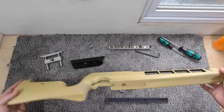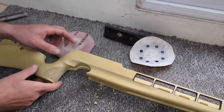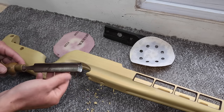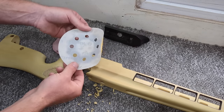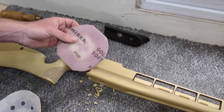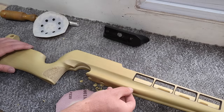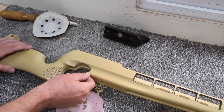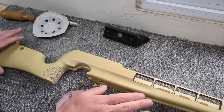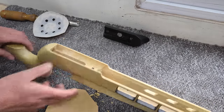Right, let's get the chisels out. We're going to knock off a little bit off the edge here and then start keying it up for some paint. I've just put a little bit of a relief in here that straightens up my trigger finger a tiny little bit. Because of how soft the poplar is — walnut or any of the hardwoods you can do that with a gouge easily — I just had a few swipes through and then came at it with 240 to blend it in. The lacquer's now blended into the exposed woodwork. What we're going to do next is go over it with 320, very carefully. These are sponge-backed pads. You need to be incredibly careful — you can see that little swage line there — we don't want to break through the lacquer in those areas. It's very easy to put too much pressure on and expose the woodwork, so we're going to go very gently over it with the 320, then look at sealing up the exposed piece of woodwork here.